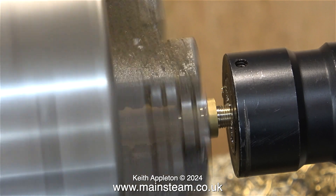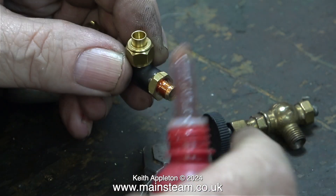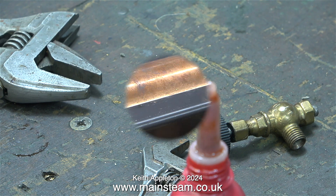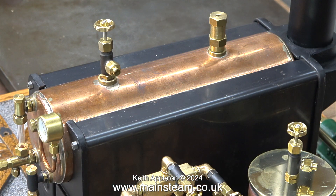I rewound the die under power, because anything that saves time is a good thing. I refitted the thread adapter into the valve using Loctite 542, and then with the help of a shim washer and some more Loctite 542, I refitted the valve into the boiler bush and it fits perfectly. I now think this looks quite good, as all the valves on the plant match each other.